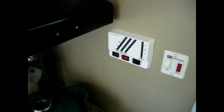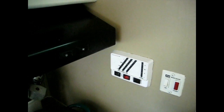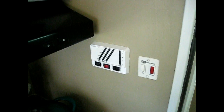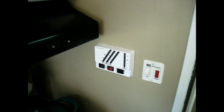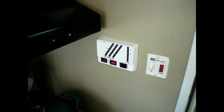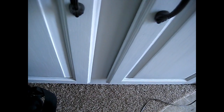We're back inside. We shut off the water. Now we are going to turn on the water pump. If the water pump doesn't stop after everything is pressurized — if it continues to run — this means there is a leak somewhere, or something isn't tight enough, or the system isn't pressurized. You will have to find that leak or find the spot that is not tightened. Maybe you didn't put on one of the caps tightly when you recapped the low drains. That's my water pump pressurizing — and it pressurized and it stopped.